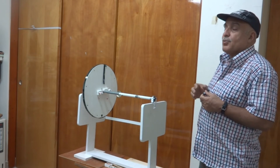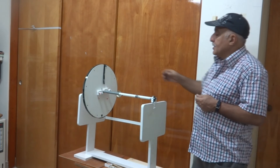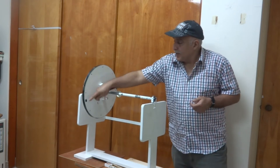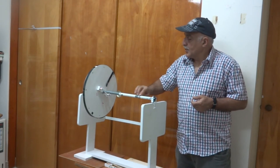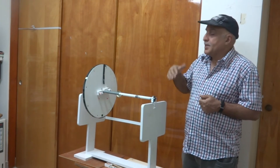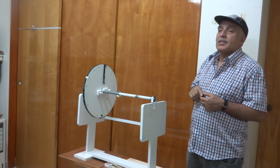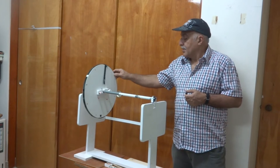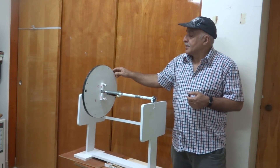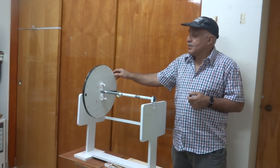And this we can do by balancing the wheel. As you can see here, there is more weight on this side around this rotating axis. This weight should be the same around the rotating axis. If it is not the same, then the heavy part will be exerting force on the bearing and it can cause damage to the machine.